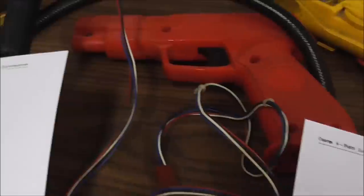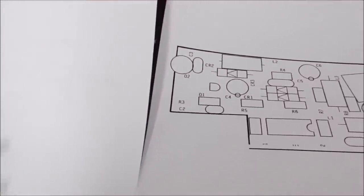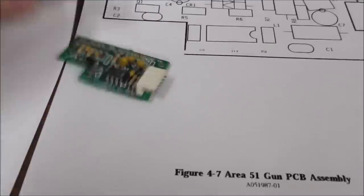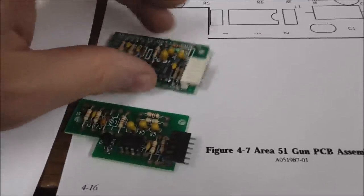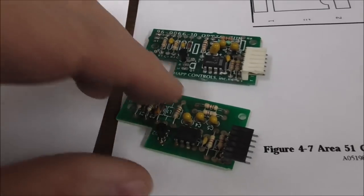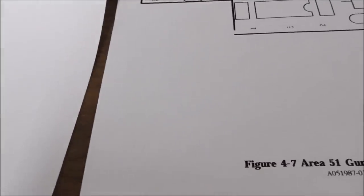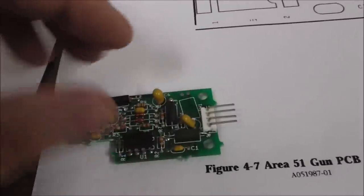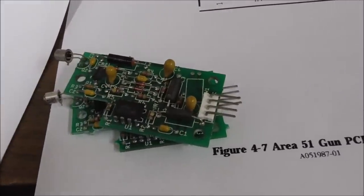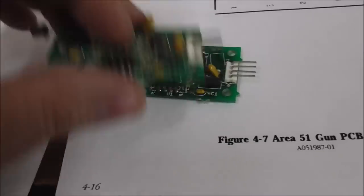Okay, folks, so I put all the screws back in that one. I've got it all buttoned up because I'm about out of that particular style that I'm going to be able to repair. So I've got 2 left, and they are both missing the inductor, and they're both missing the optic. So I'm out of inductors is my problem. So I started going through and checking. That inductor's bad. That inductor's bad. I stole that one. They're all bad. All the ones that I've got left are bad.